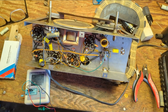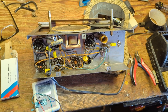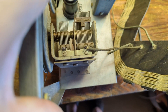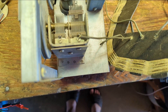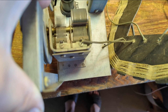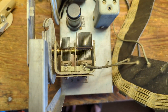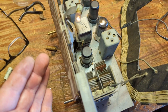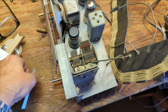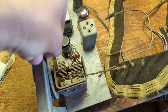It's picking up but with horrific reception. Either the antenna is messed up or it's just thrown out of alignment. I recently had a few sets where the alignment was just hilariously off. Let me flip it up and see if tweaking that makes any improvement. We have a lot of contact happening in this tuning condenser — the fins are touching, which is probably killing my signal, and it's across the board. I need to clean these fins out and maybe bend them outward so they're not rubbing. I used a little strip of business card — you just run it down the fins like that to clean them out.